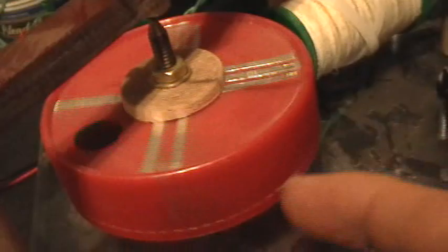You can see that there's no core, so there's no cogging at all of the magnet rotor. I just have to give it enough of a starting spin to get a little bit of a voltage pulse into that coil to flip the comparator — and off she goes.